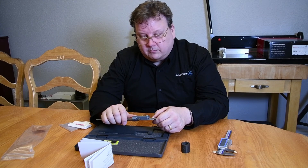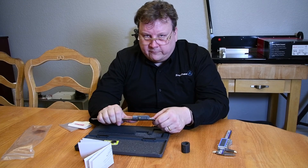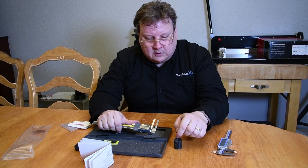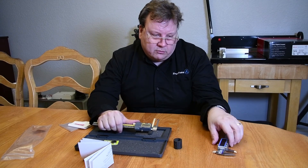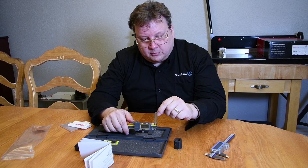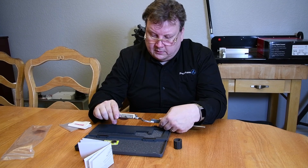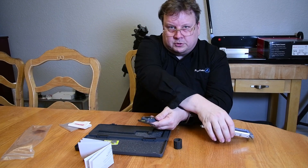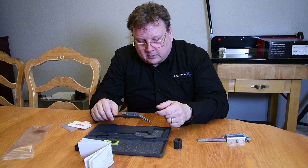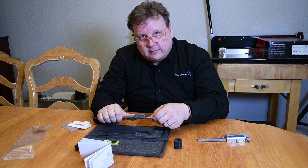That's about it for this caliper. It's an absolute origin, so it always knows where zero is, but it also has relative origin as well — very handy for measuring inside diameters. It really shines especially if there's an inside groove you can't reach with a standard caliper, because the protrusions are about five millimeters deep, so you can measure an inside ring as long as it's not more than about four and a half to five millimeters deep. Thank you for watching. Have a great day.